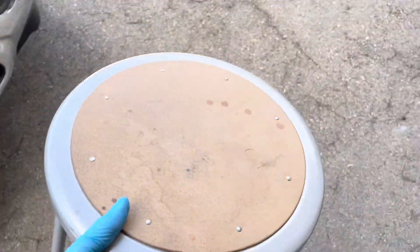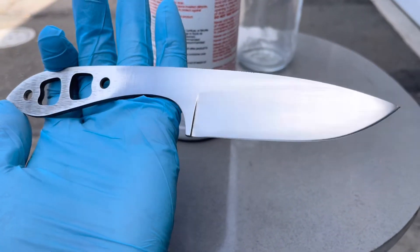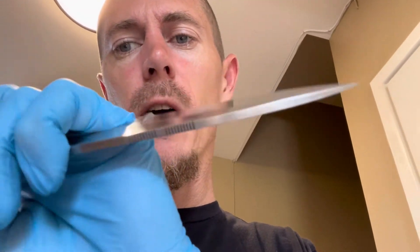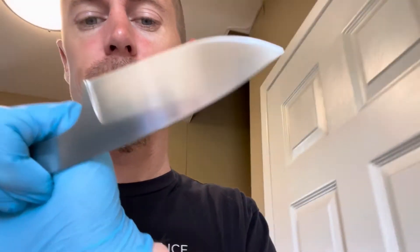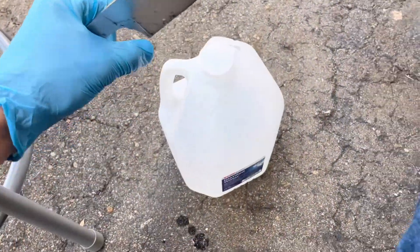Let's start. I've got my cup and my jar. First thing we need to do is clean the knife with soap and water — get all the oils off the blade. Any oils or anything on the blade could prevent it from getting an etch, so I'm cleaning everything off so there's nothing in the way of the acid etching the metal.